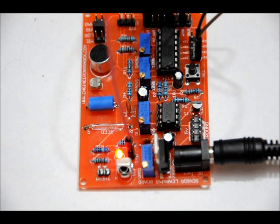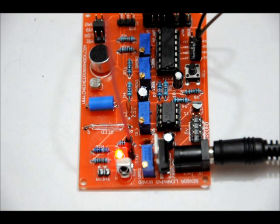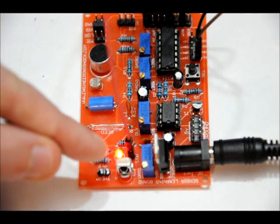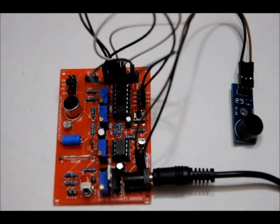You'll be able to tinker around with all this — lots of customization depending on how you want to use your circuit. For our buzzer attachment, connect VCC to the 5-volt line on the power supply pin block, ground to a ground pin on the power supply pin block, and then connect the CP1A pin to the buzzer input.